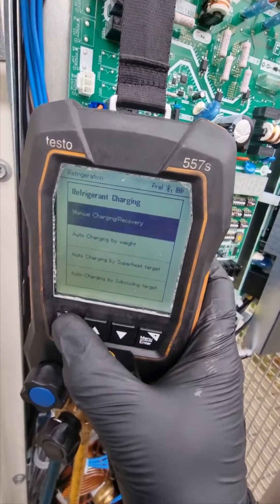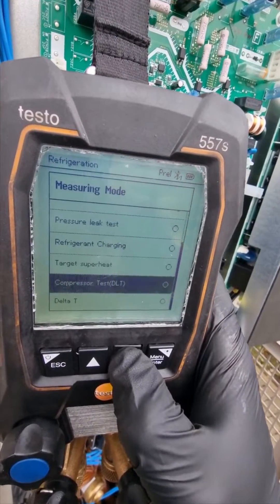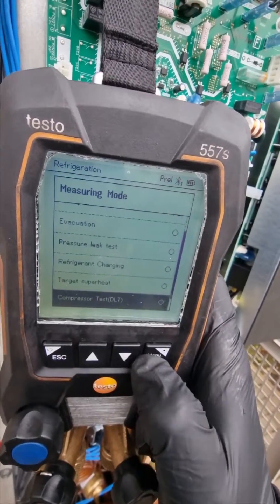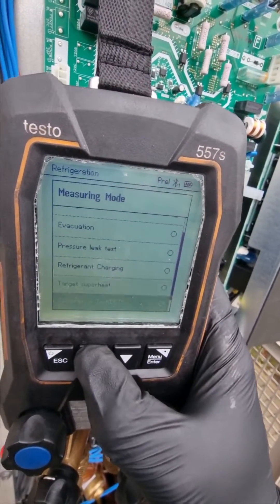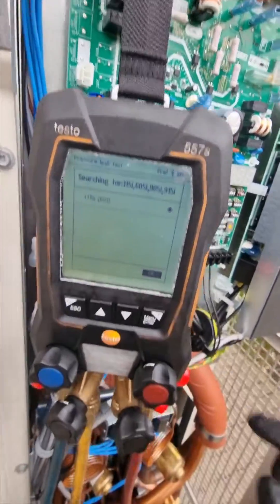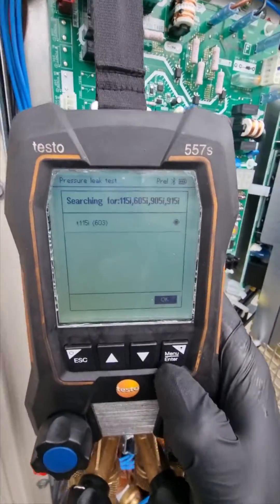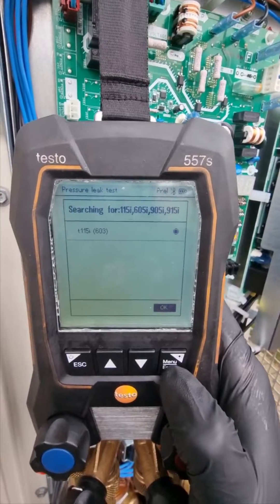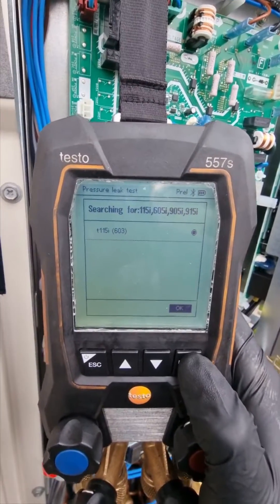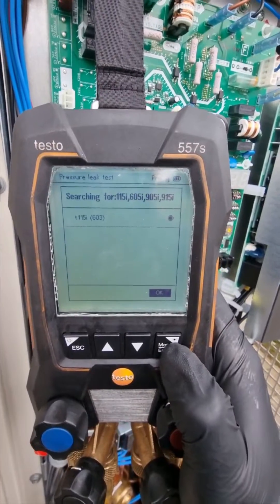You can connect to the scales from here, which is very nice. Then you've got target superheat and pressure leak test. That's connected to my clamp temperature gun, which is going to act as my ambient air sensor — it'll compensate for any changes in air temperature which will of course affect your pressure. You can do that manually; I think I've done a video before on how to do it manually if you don't have fancy gauges.